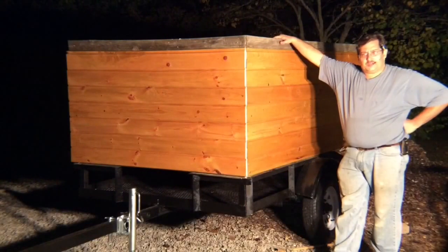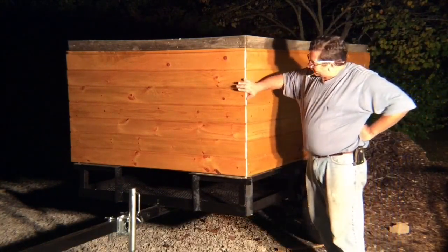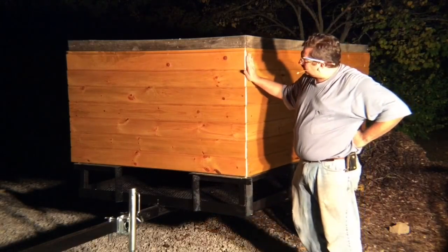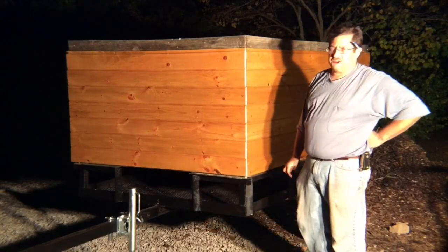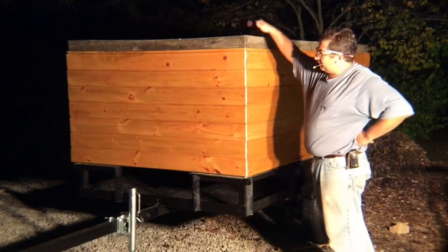Well, that sure went a lot quicker than I expected. Still took a while, but got all this solid tongue and groove on, 21 pieces, 7 on each side, and then I'll use an 1/8 piece ripped down to finish the top after I put that 5/4 up.